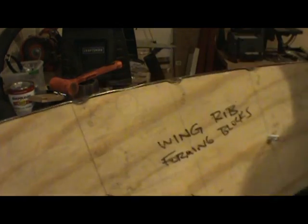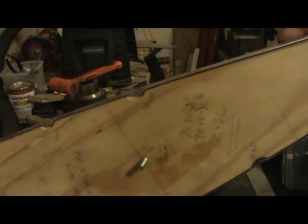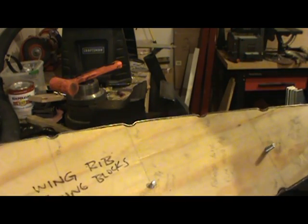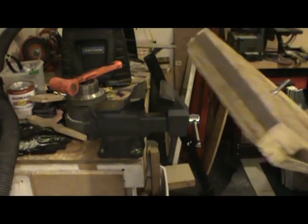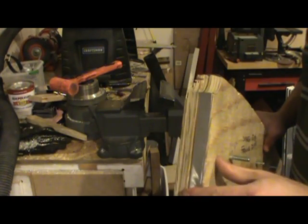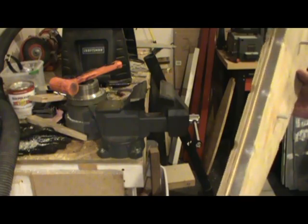Here's the edge of our flutes — very little wavy curvature between the flutes. Even the tail end of the wing is quite straight and smooth, and that's what ends up being our wing profile. That's what sets the shape of the wing when you put the skins over it — the skins rivet right to this flange. This flange also rivets to the wing spar, which is the main structure of the wing, and then there's a rear channel angle that this rivets to in order to finish up the structure.